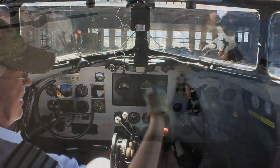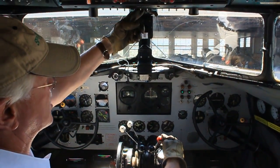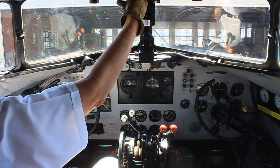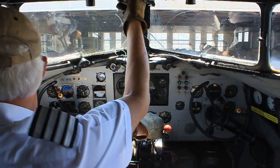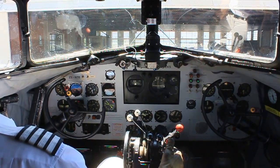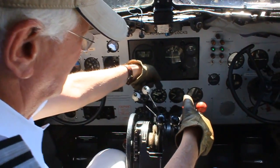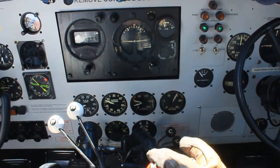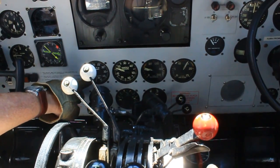It is on already, it is in idle, in the auto lean position. I am going to switch the pump on and turn the engine, then go to cut-off. The pump goes on, I am turning it, and the moment it runs — there it is in idle cut-off. And it is running. Wait for oil pressure; fuel pressure we have, hydraulic pressure we have. I may just help it along — there it goes up.